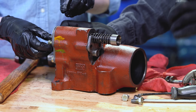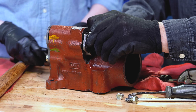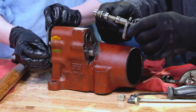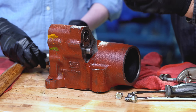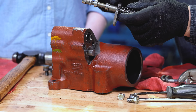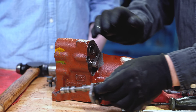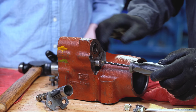I'm going to start disassembling this — I already have a head start with the bolts removed. This is the up-and-down spool right here and it gets stuck. If your tractor has the problem where it lifts the implement up but when you put the lever down nothing happens, this is what's stuck. The oil is simply off here, and when you open the valve the oil runs past. The other part of this valve that people don't take the time to fix is the next little valve down further.